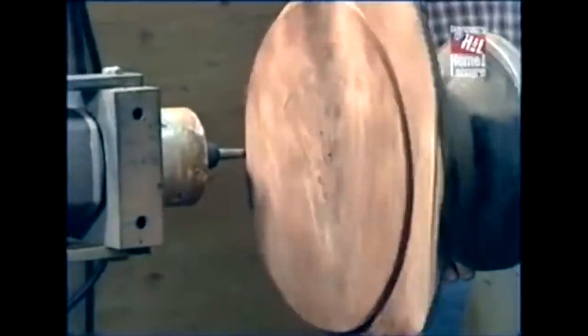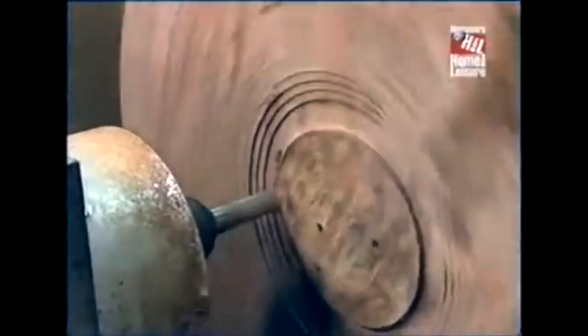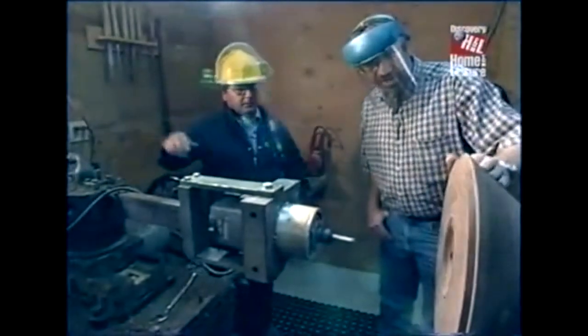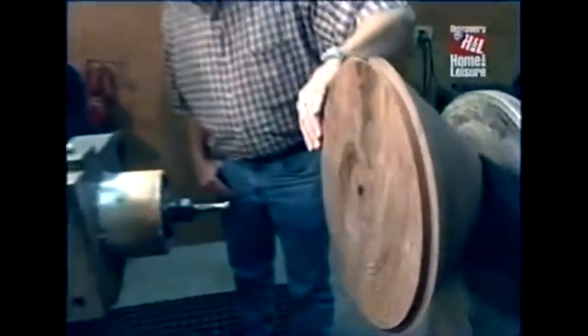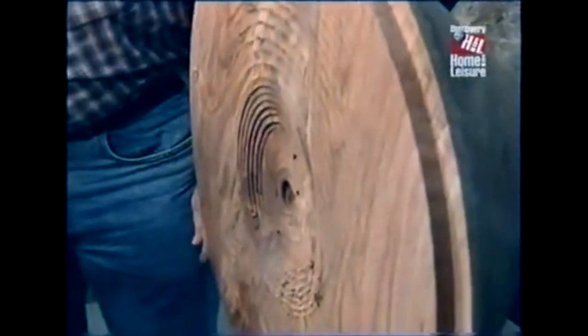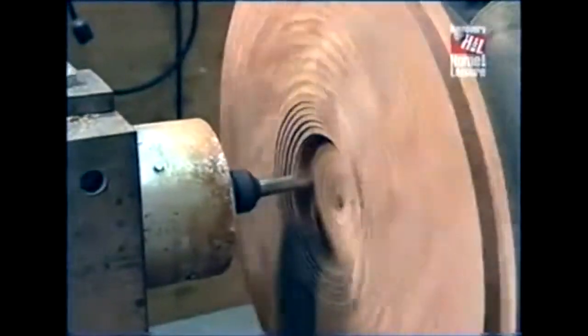Now you've removed the faceplate and attached it to the bottom of the blank for the bowl, and you're reattaching it to the lathe. Now it looks like you trimmed off the excess here, and then you flattened the face, and you started to dig out the center. And now we're going to start from the center and work out so we have plenty of outboard meat here so that the bowl doesn't blow apart on us right away.